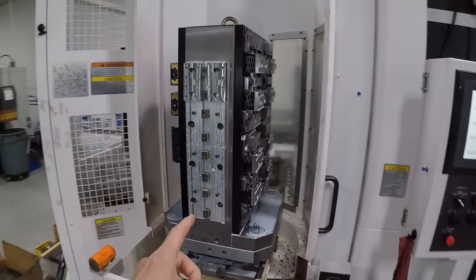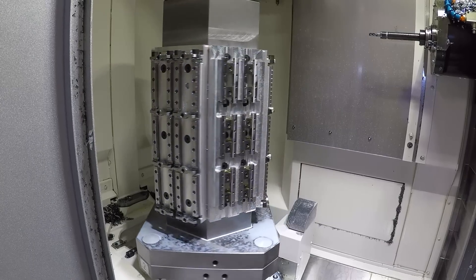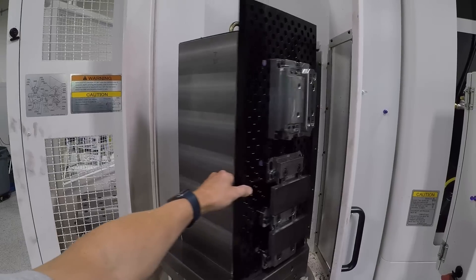You don't have to make a tombstone — they're readily available and lots of folks sell them. The three sizes and shapes we bought: the first was a traditional T-style or slab style where most of your surface area is on opposing faces, although we're actually able to use the shorter five or six inch ends as well. We also have a six-sided tombstone and a traditional four-sided square tombstone.